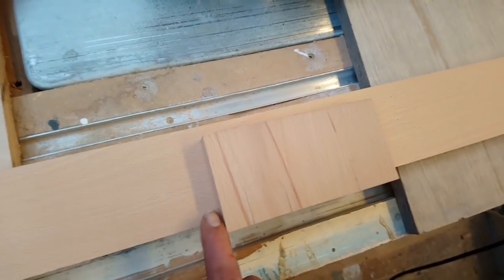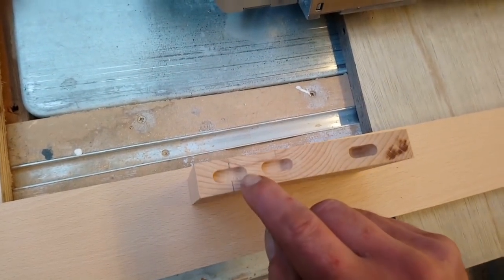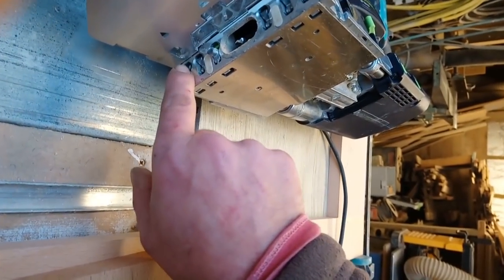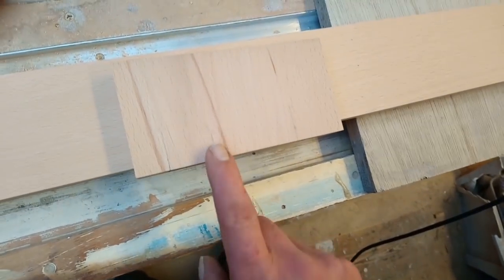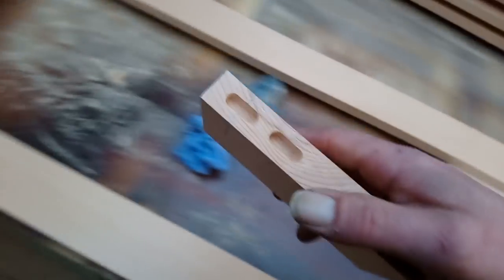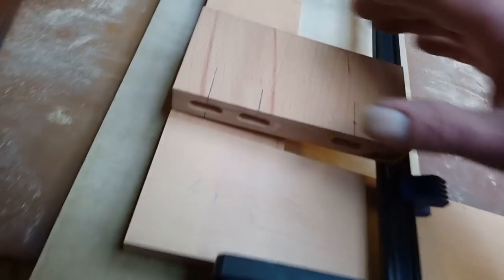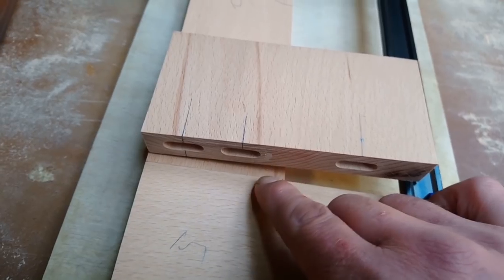First cut with the pin against the edge. And then the pin up against there, which does this second cut. It's the same as the third pin. If I open that third pin and put it against there, it cuts in that position where that is. That'll be the top. Like that. And you see, I've just got enough to get the groove on there.